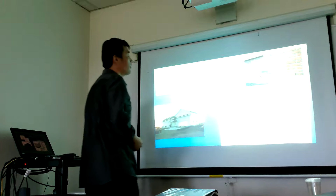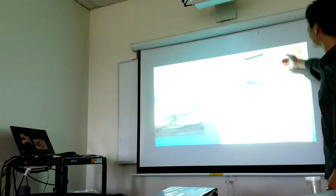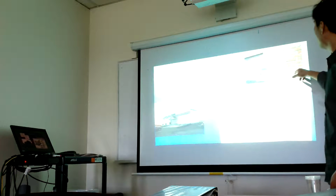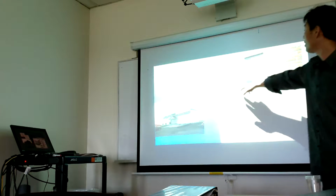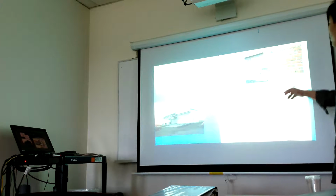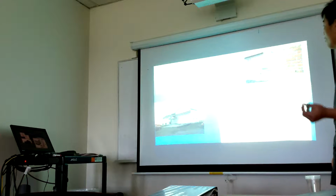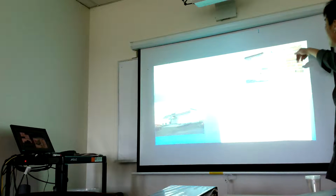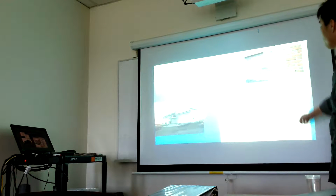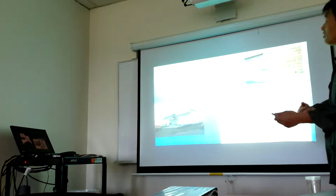And we can see that in the last image, the water comes down, and we will find a way for it to go out. Now we can see here, it's called a weep hole. I think every 4 pieces of brick we have a weep hole. It's maybe half an inch or a quarter inch. The water comes here and it can go outside. It's for brick veneer. You can see that it goes out. So I think it's very logical.